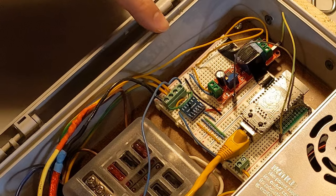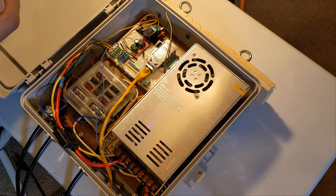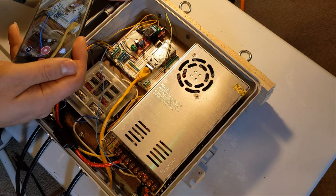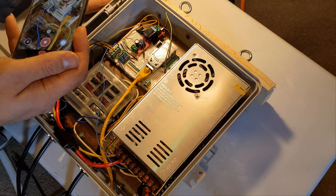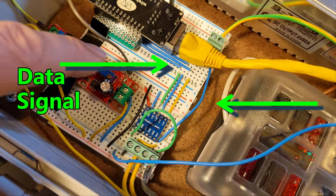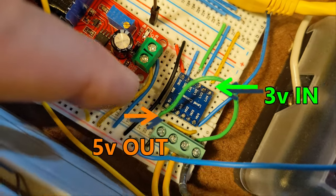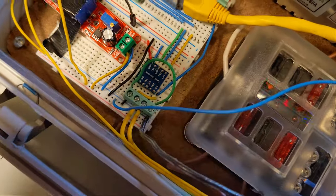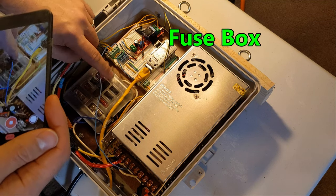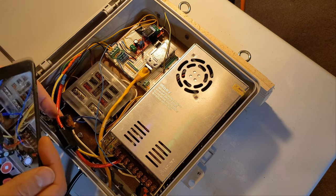The next part is this little blue component here — this is a level converter. If you're familiar with the hobby, you know that the data signal sometimes degrades, and the farther your lights get from your controller, you'll see them flicker on and off. That's because the data signal comes in on a 3-volt line, and the 3-volt data signal degrades really easily. Some people put a single pixel in to boost it to a 5-volt signal. The other way is using a level converter like this one. The data signal comes out from the controller on three different pins, goes right to this level converter — the 3-volt data signal comes in and is boosted to 5 volts on the output side, and that's what travels out through the pigtails. All the data is protected by this switch box with automotive fuses, all fused at 10 amps, and I also have the controller fused at 5 amps for safety.